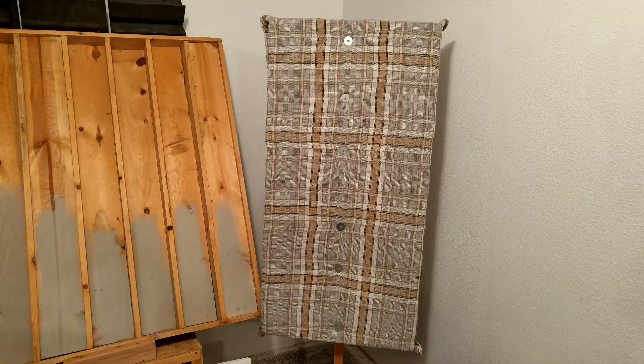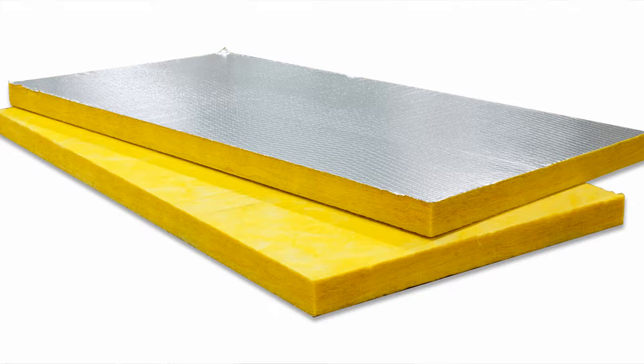Now in the control room I use four-inch panels — actually made out of two two-inch thick panels. I recommend Owens Corning 705 FSK. 705 is more dense than 703, and FSK is a foil back. The reason for that is more density and the foil backing work together to absorb low frequencies much better. You mount these with the foils back to back, and that allows more efficient absorption of low frequencies without taking away the efficiency of the high frequency absorption.